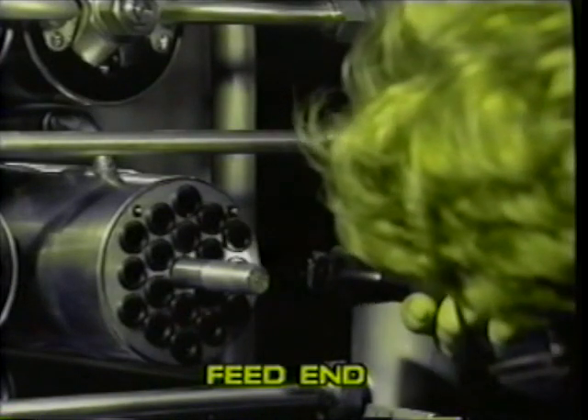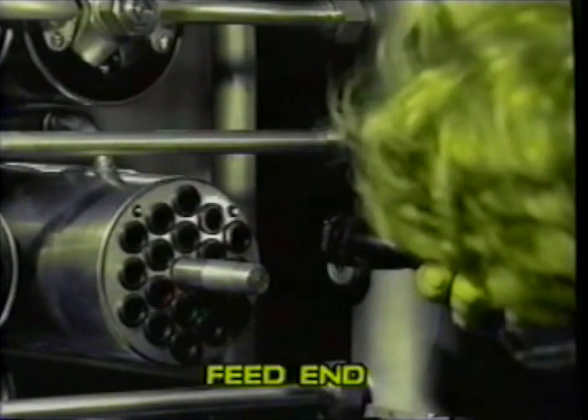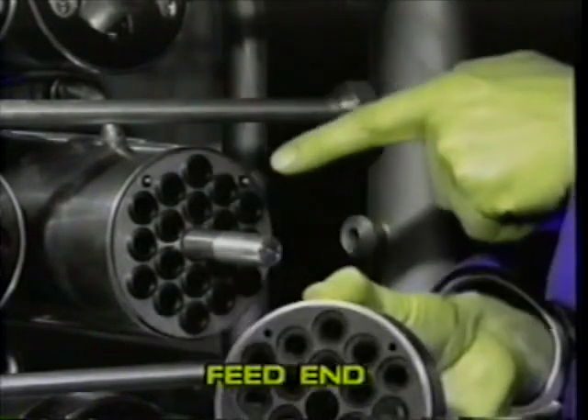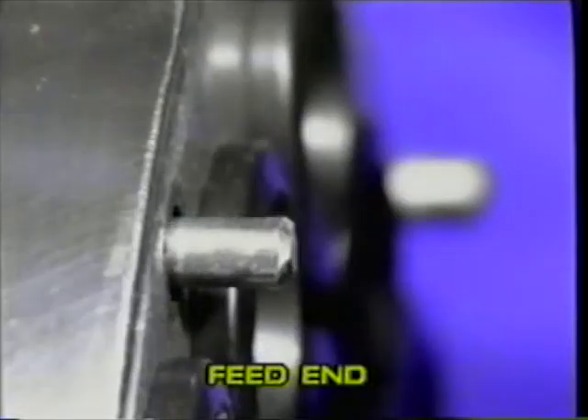Using a torch, make a final check that each tube seal is properly seated. It is necessary to fit the end cap loosely at the feed end. The end cap should always be fitted individually — never fit them with the piping connected.